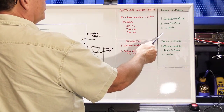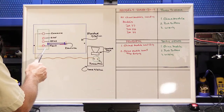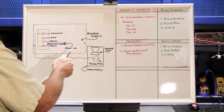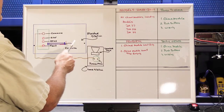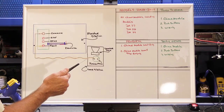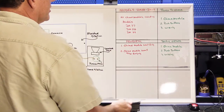There could be a fourth item — checking the master station. It's possible that the chime module is activating appropriately and sending the right signal, but due to a failure in the master station the tones aren't being heard throughout the system. Checking the master station requires a second known-good chime module to swap in, which most people don't have, and it's probably the least common problem anyway. The recommended testing order is: check the chime module first, the push button second, and the wiring third.